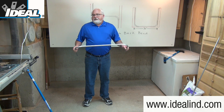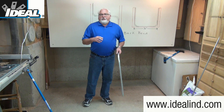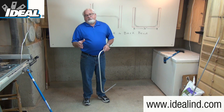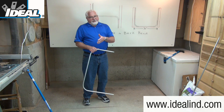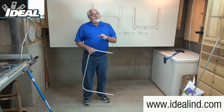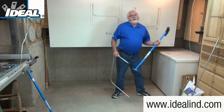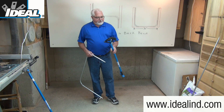This technique can be used anytime a second stub bend is needed in a length of conduit. Knowing how to make a back-to-back bend quickly and efficiently will make those jobs run smoother and add value to what you can do as an electrician on the job site. Electricians don't bend the conduit and then cut it to the right length — once they know how to use a bender correctly, the conduit is the correct length and fit for that particular job. A good quality hand conduit bender like this one from Ideal will provide accurate and professional-looking bends that electricians expect.